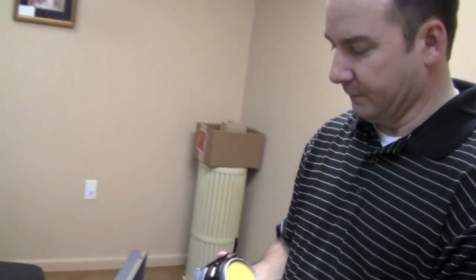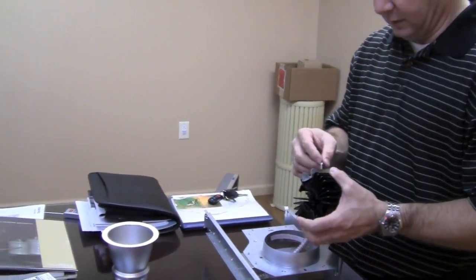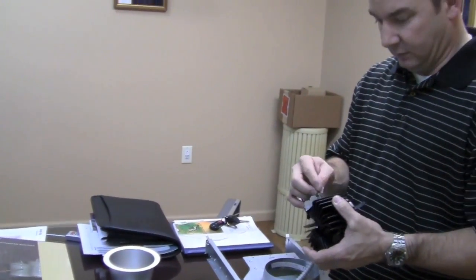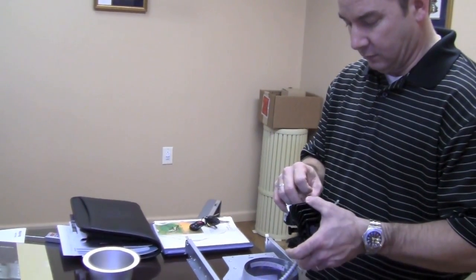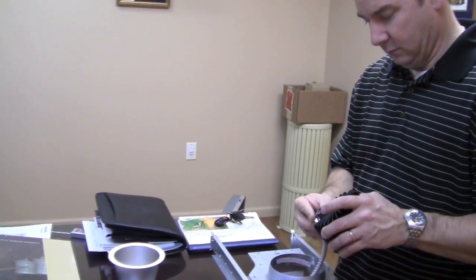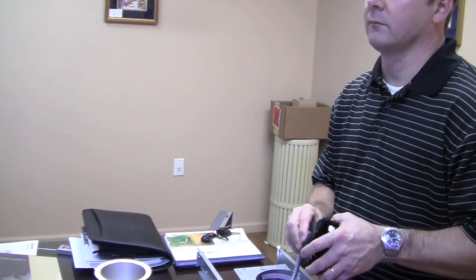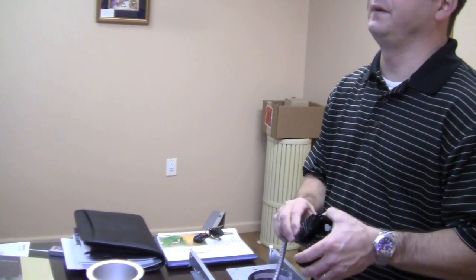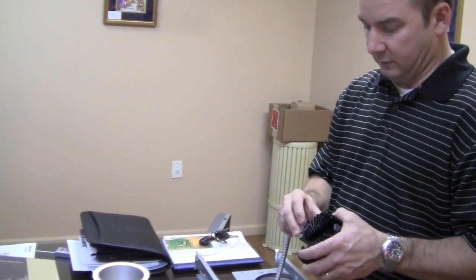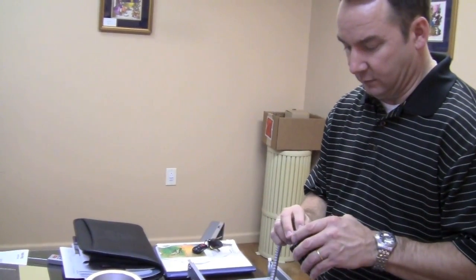All right. Now, Rick, when you're doing the LM70, I guess the L70, for the life rating, you're saying at 70% of its life, you'll have lost 30%. No, we're saying at 50,000 hours, we'll have lost 30% of the initial illumination. Right. Is that a definite or is that just a prediction?